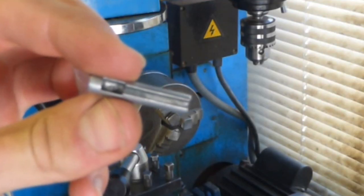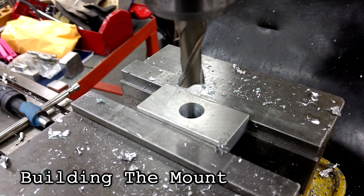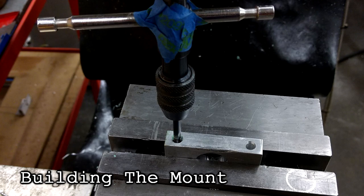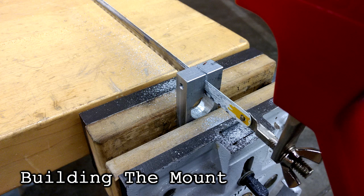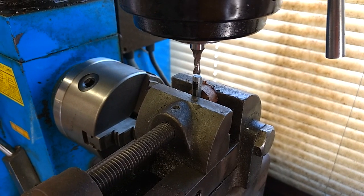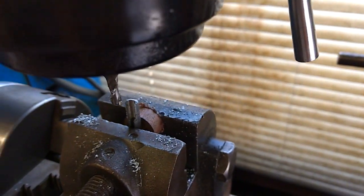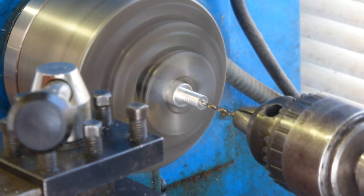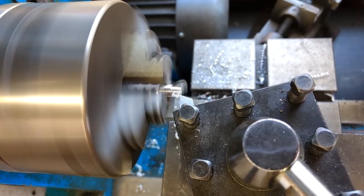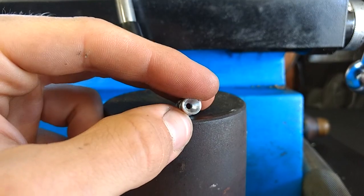It was definitely not designed for a bike because the cable stop is a different size. I first made the handlebar mount out of a block of aluminum, drilling a 7/8ths inch hole in it and mounting the screws in it to match those on the shifter. Then I opened up the shifter, took out the cable stop part, had to clamp it in the vise in a precarious way to mill out this area, and amazingly I was able to get it so the cable fit in there. I also had to make an adapter to fit the shifter cable housing in, so I just turned a piece in the lathe to fit into the original one.